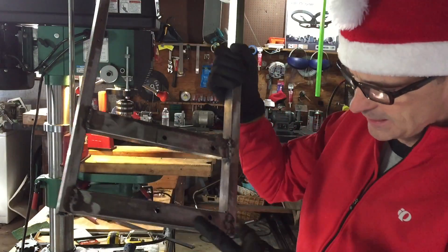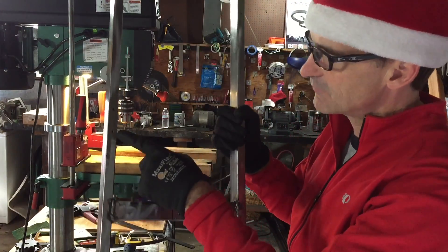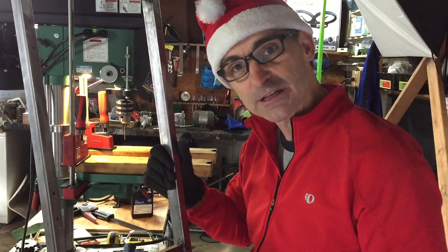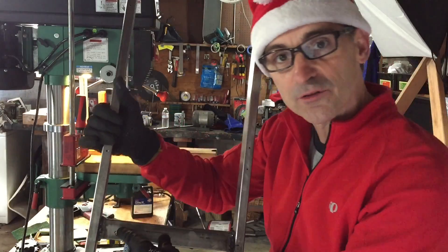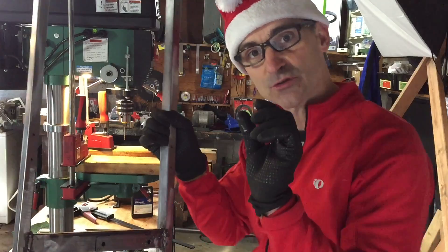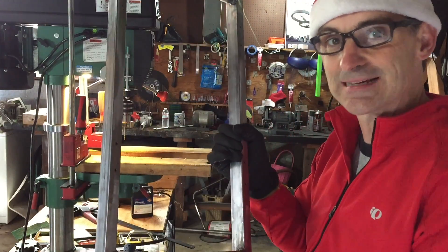Okay, so now I have my four big holes here for the motor mount, and then I've got some smaller holes for the pillow brackets. I just want to tack everything into place and make sure it all works. These holes are all through-and-through, so what I'm going to do next is tap each of these so I can put machine screws through and then put nuts on the other side to hold everything super, super tight.